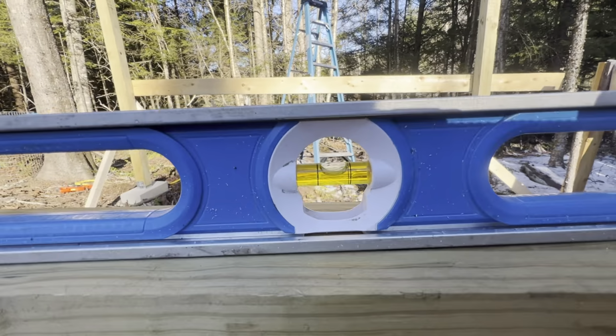So I'm gonna drive this 4x4 into the other ones with these 8-inch timber locks. They're a little overkill for this probably, but it's what I have. Can't use normal screws obviously because it's so far in. So fasten it down with these with the big beefy drill real quick and we'll be in business. All right, everything's looking good. Got this thing all tied down. Everything's level still. Next step here is to essentially build rafters.